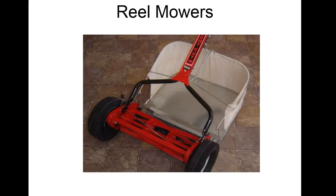With a reel mower, once grass gets beyond a certain height or if seed heads come up, they'll just wrap around the reel and it won't cut — you'll have to mow them down with a rotary first. These push reel mowers are probably the lowest maintenance you can get. In places like Puyallup on the west side, they use reel mowers because they have bent grass and fine fescue, which can't be mowed low enough with rotary mowers.